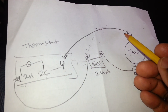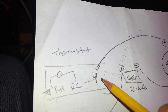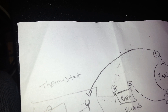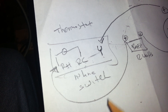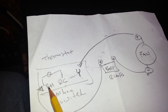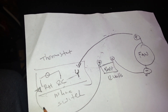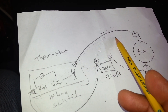So in order for me to get a positive cable connection between RH and RC to Y, the relay has to close here — that's the gap right here. So on the positive terminal on the fan, I have a wire coming all the way over here. The Y terminal is on the cooling setting, so when the relay engages it's going to bridge these together. This is just acting like an inline switch — that's all the relay is doing, acting like an inline switch.